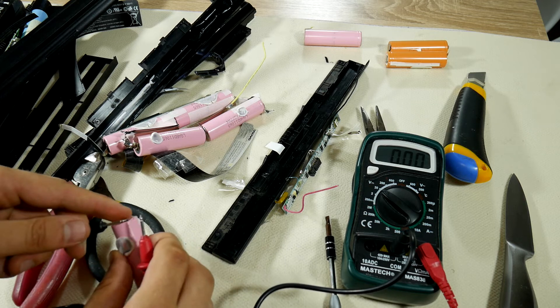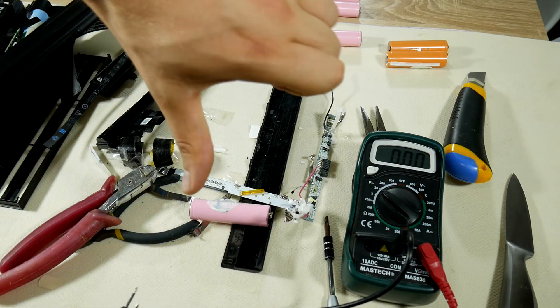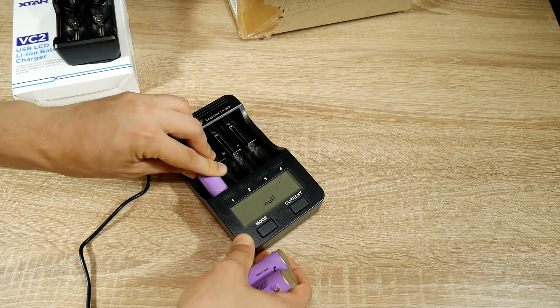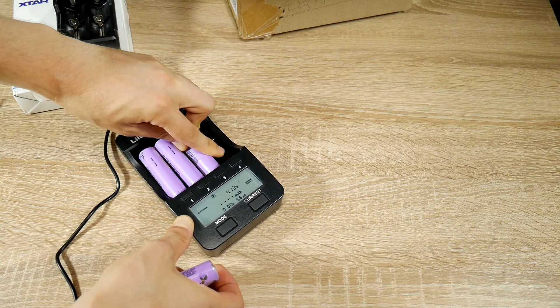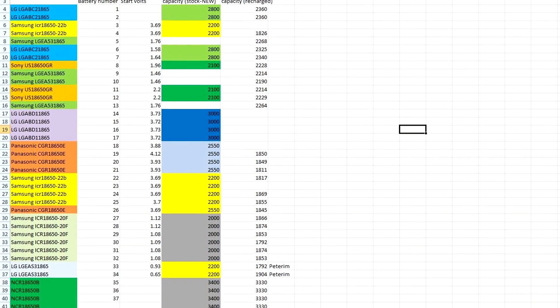What's up with the other cells? Very nice — 4 new elements and the last one is dead. After a couple of hours of work, I have a nice pile of future gold nuggets. Now all these batteries need to be recharged to find out how many good 18650 batteries we have. Take a charger that has a test charge cycle — it charges, discharges, and then recharges the battery. Then just start charging every cell. A week later — at least that's the time it took me to recharge 41 batteries — I got a nice deal.